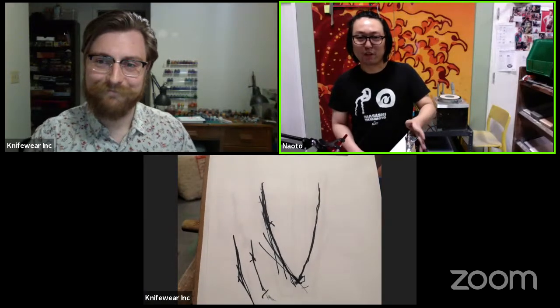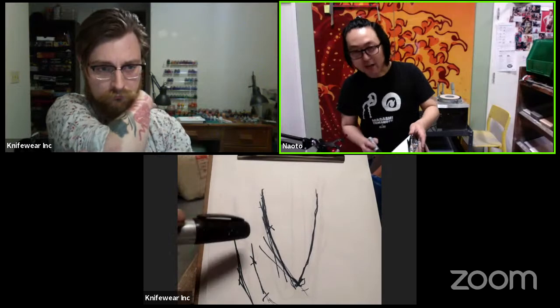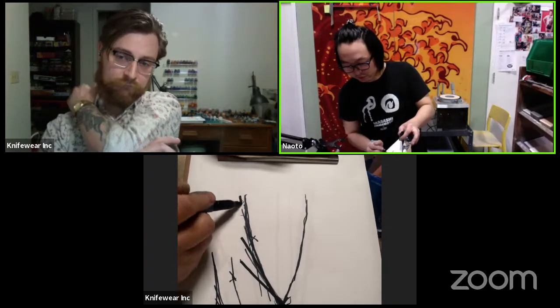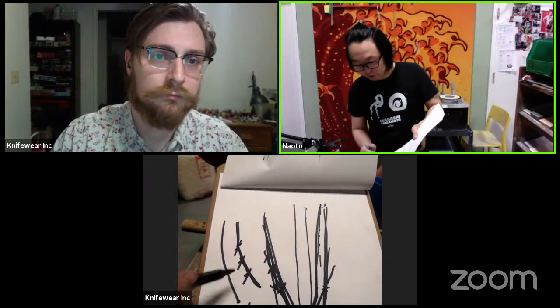So what we did today, in order to attain this nice convex edge on the flat stone, I had to make several different angles. So I started out with this flat angle, then this flat angle, and this flat angle. I did about 2 on my deba. Depends on what type of edge you are sharpening, you can do that. But when you do this, you end up making flat lines like these. So I used a little bit of softer stone to break these edges down.